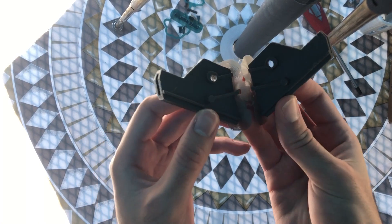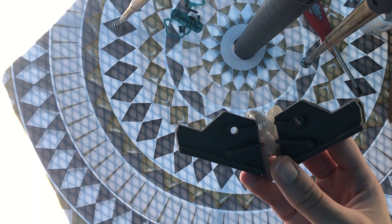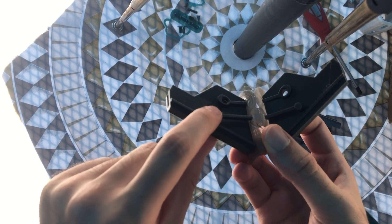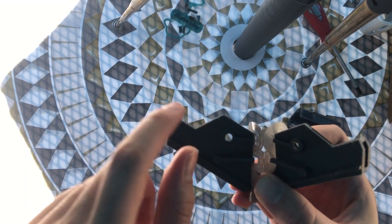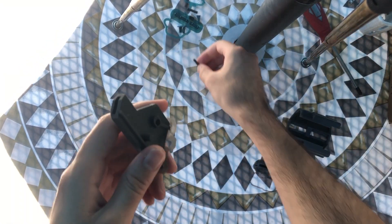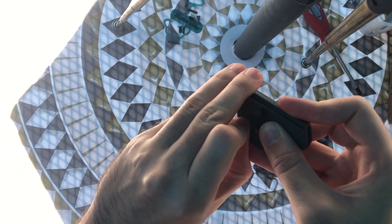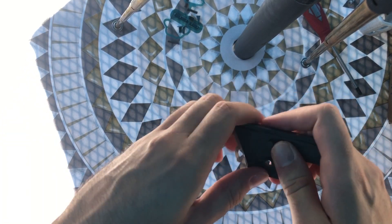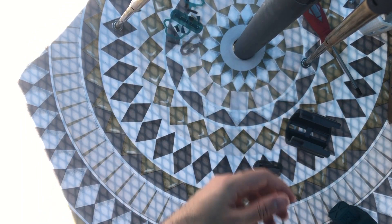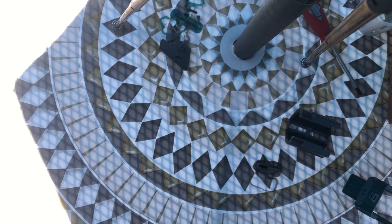The slides are completely unchanged in design, but instead of suppressing a ton of support material, I used the same breakaway stem technique. There are two stems holding up the pin area, and the section where the metal pin seats — these just break off cleanly. The first time I've actually broken these apart live here. The second one breaks off super simple too, probably easier with pliers but fine by hand.